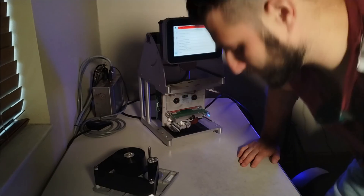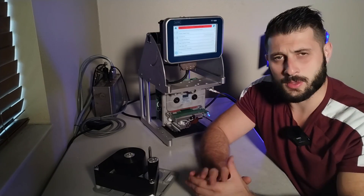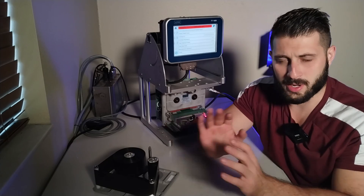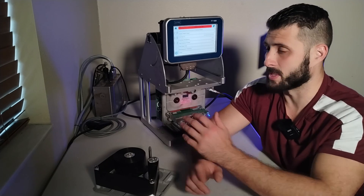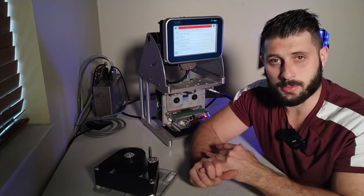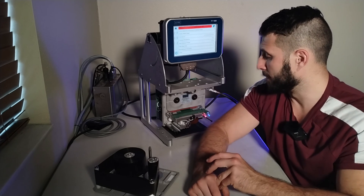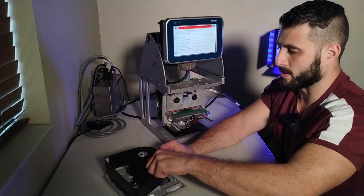We suspect that interconnect board has the detection issue. Well, we're back to basics — I jumped into the circuit boards assuming I knew what I was doing, and obviously this Lynx printer had something else in store for me. Turned everything back to normal. Going through the diagnostics: tools > diagnostics > printhead health — found 18 dead dots. So we know we're going to need a printhead, and also a printhead circuit board since that was trashed from before. We're still getting that flash on the LED and most likely still getting incorrect reel size.